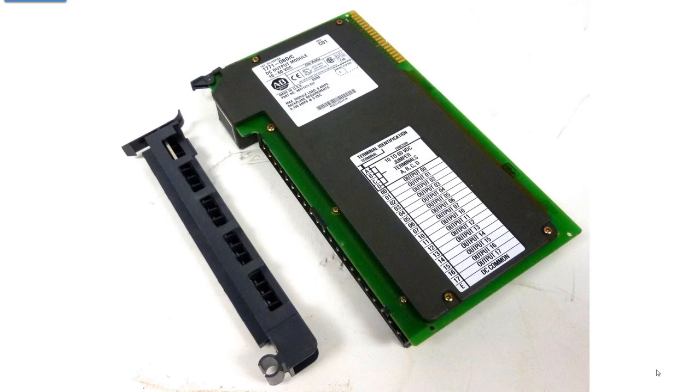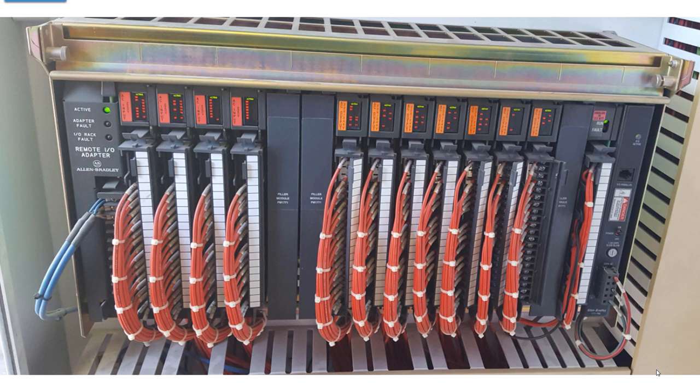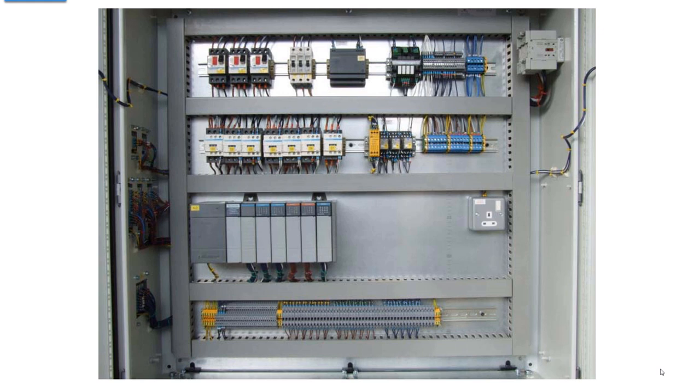The I/O modules slide into the chassis, and there's a swing arm that pivots on a bottom rail. At the top of the terminal strip, there's a little tab — push it down, release it, and the module pivots down so you can remove the card. One unique chassis shown has no processor; instead, on the far left there's a remote I/O adapter with two blue network cables coming in. All that I/O reaches the processor in another chassis by way of a network. The power supply on this chassis is on the far right — a single-slot supply that powers the backplane for both the remote I/O adapter and all the I/O modules.